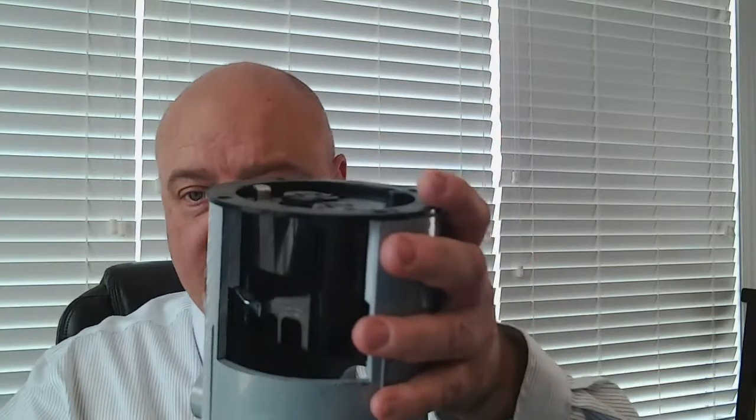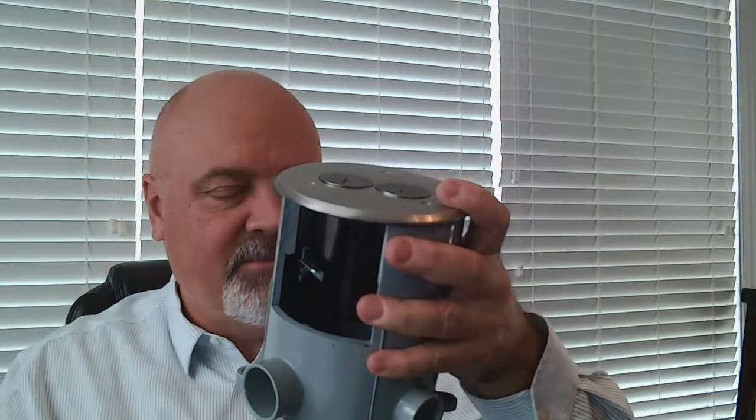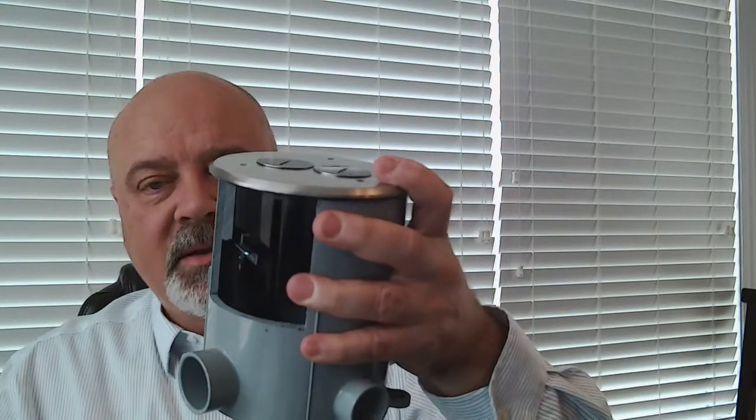At that point, after it's wired up, you'll install it, and then you install your all-brass cover, and you've got a pretty nice looking, very economical concrete floor box in a junction box that you already have in stock, with an Allied Moulded floor box that you've already got in stock. And if you don't already have the FB-CAK kit in stock, it's very simple to call your manufacturer's representative, and they can get you the pricing on that.